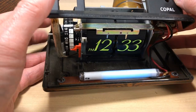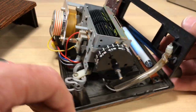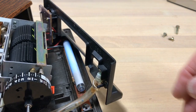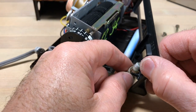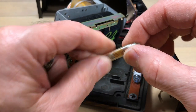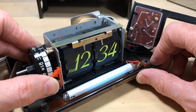The photo cell's purpose is to dim the light when it gets darker so you don't need as much illumination at night. I tested it off camera and it does still work, but it only dims slightly. There's a green neon glow bulb - that green complements the black light against the green numerals. You can see the black light tube there. Those tubes are often not operational at this point, so I'm lucky to have one working. I'm going to replace the green neon - I was lucky enough to get a stock of new old stock green neon bulbs that are perfect for this application, and they come with their own resistors.